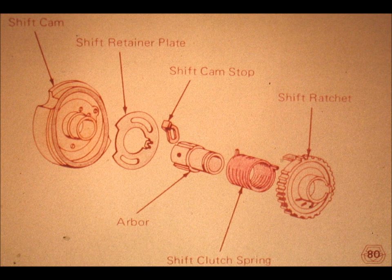As we have seen earlier, we can interrupt the rotation of the ratchet with a shift release arm or latch. The all-important fact to remember is that the shift clutch release arm or latch first interrupts the rotation of the ratchet and not the shift cam — not yet anyway. This amounts to saying that the shift cam continues to rotate because of its inertia. At this point, please reverse the position of your sound cassette so as to continue by playing cassette 2, side 2.